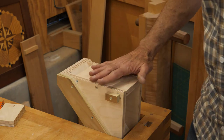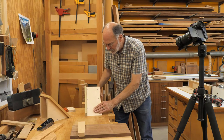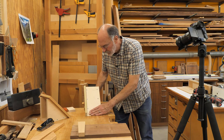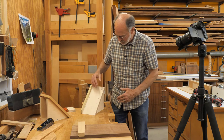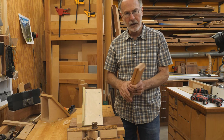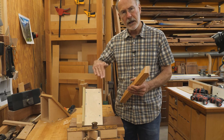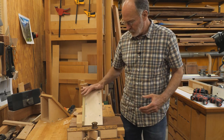I'll go back and forth and test a few times until I get the 45 just right. I've got this dialed in now. I'm getting nice 45-degree cuts for a total of 90 degrees. It took another set of passes with my block plane to get it to the right angle, but now it's dialed right in. This is good to go.